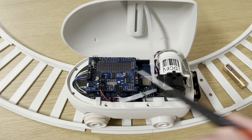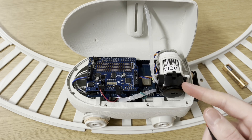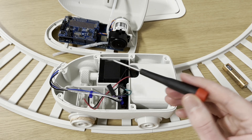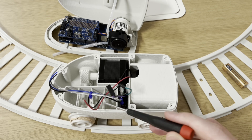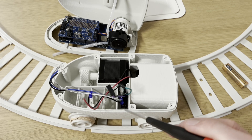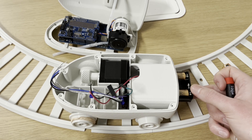Plugged into that we have the Adafruit Motor Shield V2, which controls the driving and the pumping of water. Here we have the water pump — one hose goes up and out to water the plants, and the other goes down into the water reservoir. Down below is the main drive motor geared directly to the front axle, with rubber bands wrapped around the front wheels as tires for better grip. Here is the removable water reservoir, and down here is the IR sensor that detects when to stop to start watering a plant. Everything is powered by three AA batteries wired through to the board.